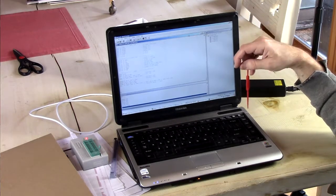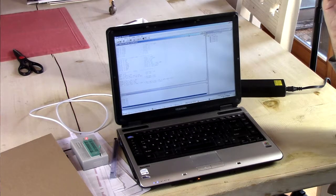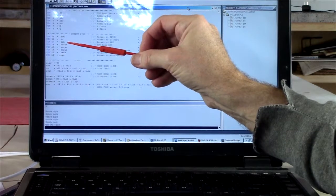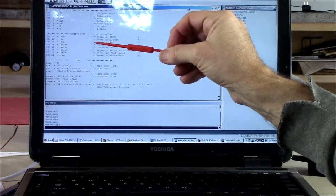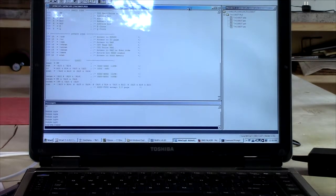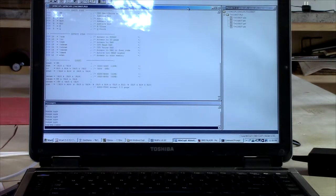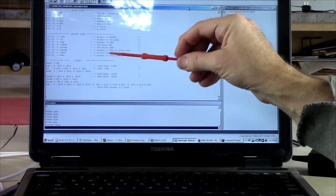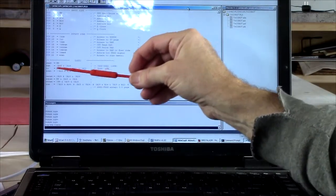Well, the way this thing is designed, it will attempt to make use of Don Lancaster's cheap video cookbook methods. So there are times when you enable the RAM when you're actually reading ROM. Okay, so that's for the chip enable signal. The RAM signal is just when the processor is trying to read or write the RAM. CE RAM is if you're accessing the RAM or you're running in what's called the scan code. And we'll probably get more into that down the line as we get into the programming of this thing. And then there's an inverted read signal, which is just the inverse of the processor read-write signal. Anyway, the logic is down here.